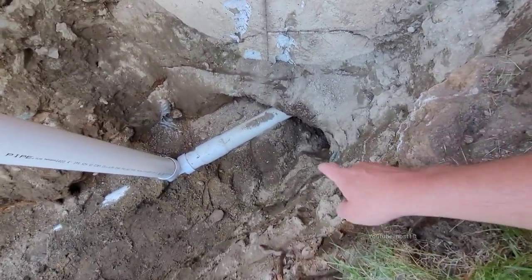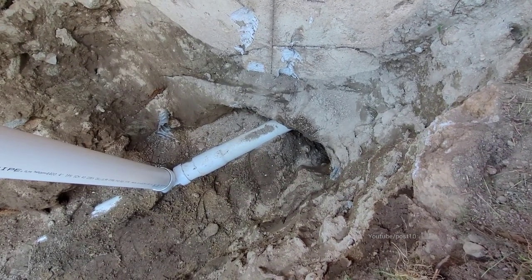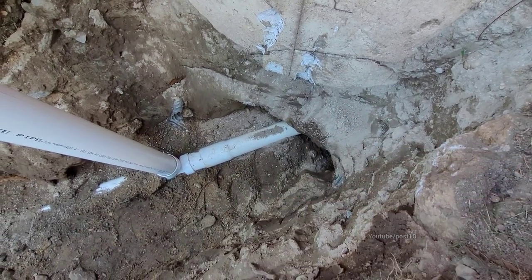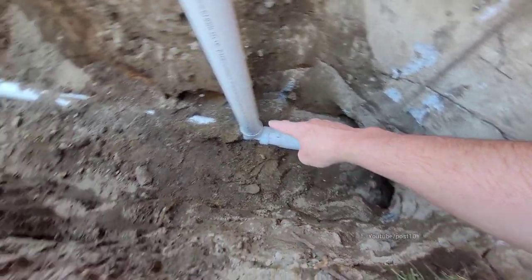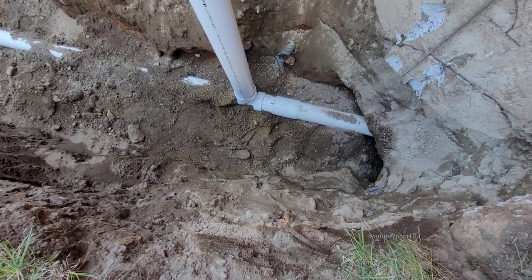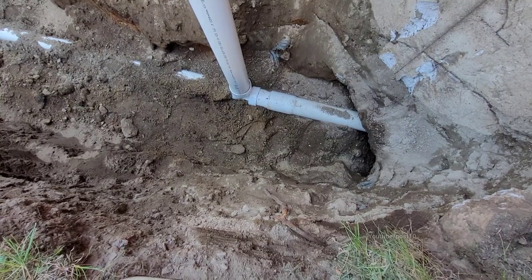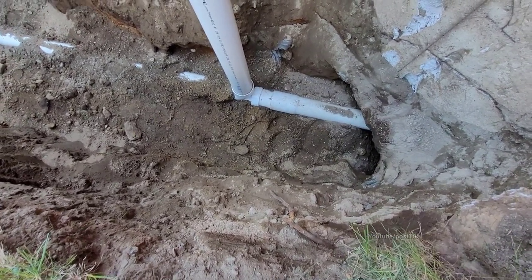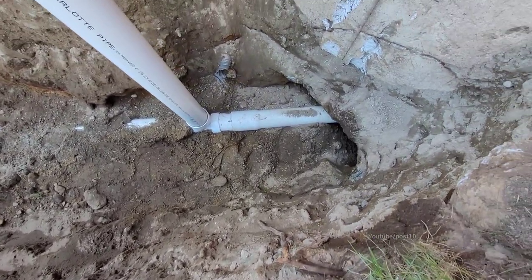And you can see down there, there used to be a perimeter drain on the exterior of the house. Now there's a new perimeter drain inside that collects the water and it's going to send it right out. But the sump pumps are going to be left in place just in case there's ever an ice dam at the far end of this. It's only a 4-inch pipe. It's possible. But also, typically when it's that cold, the groundwater is very low. Like, if this was springtime, this would be flooded. Yep, it would be just absolutely flooded.